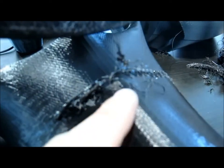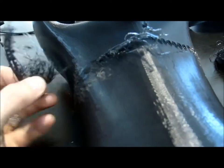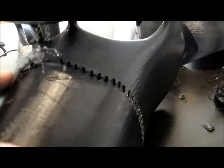This is the finished side — here I've already seam welded. You can see I'm using scrap PLA from a failed part — there's a failed piggy nose, so nothing goes to waste. I'm taking this shredded material, laying it on there, and using the soldering iron to melt it into position. Then I use it to smooth it back and forth with the heat to make it more true to form. It's pretty close to the form, and it's definitely one solid piece of plastic now. I'll continue this all the way around the nose and get it on the other side.